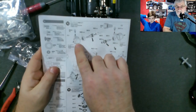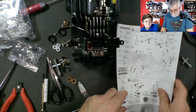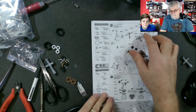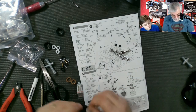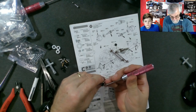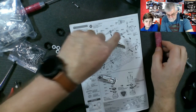Step ten is all the carriers for it — bearings, little tiny washers. That's where the washer goes inside — you can see in the picture the little rubber washers. We're going to find all these parts. Little tip on these: the rubber washer has to go in there, so if you want it to stay in there, take a little bit of grease, put some grease on there, then drop your washer onto the grease and just push it in with any tool. Push it in all the way to the bottom — the grease is going to help it stay in there. So that's there — now we got to find the big bearings.